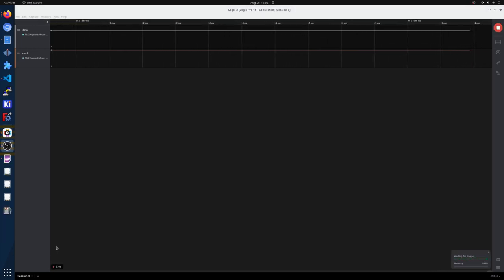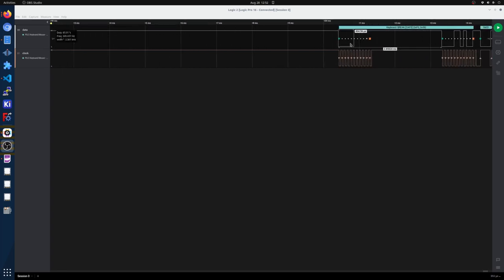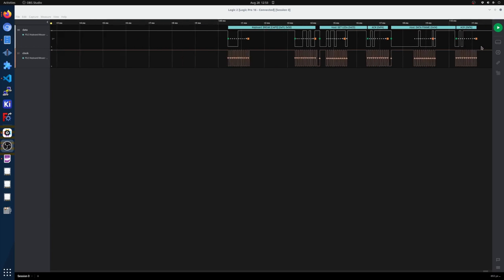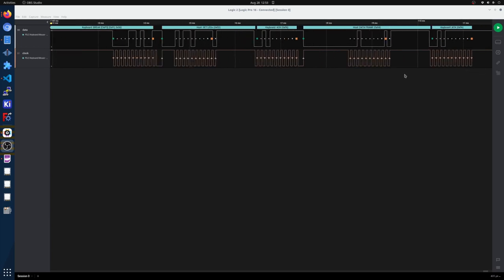When it comes to actually sending commands to the keyboard it's a slightly different process. You'd send commands to the keyboard to do things like turn on the LED indicators for cap lock, scroll lock, or num lock — these things are not handled by the keyboard, they're handled by the device controller. So when I hit the caps lock key, it just tells me I hit the caps lock key, and when I release it all it does is tell me I've released it. I have to have code to actually tell the LEDs to turn on or off based on the key press.